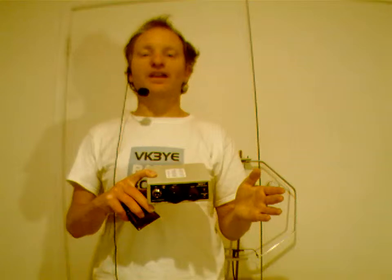I used one in, I think, the RD contest. I did a video of it, and it's a great little transceiver to try. Again, it's single band, but you can order it in either an 80 or 40 meter version. So that's a possibility: the DCT from Oz QRP, look it up on their website. They've also got an MST3, which is a bit more advanced. That stands for Minimalist Sideband Transceiver. It's single band, but you get SSB instead of double sideband.